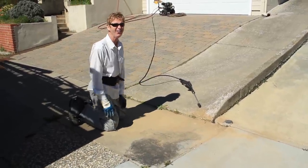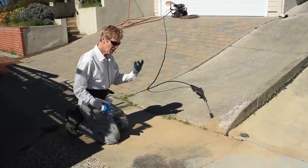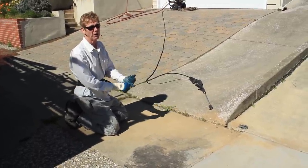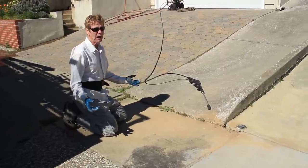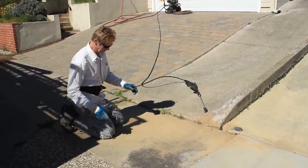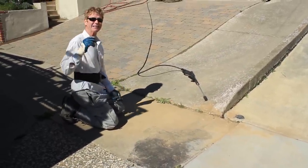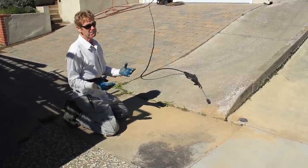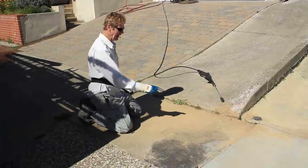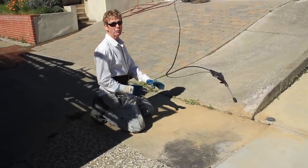She says, well, I saw your video — and I thought, oh, one of my most controversial videos. I'll put it in the description. But anyhow, there's a way to do this, but it's for plasterers or people who are professionals because the material is not sold at Home Depot or Lowe's. It's poly bond — that's at the plaster and material yard. What I'll show you is after I pressure wash this — because nothing adheres to dust — I'm going to apply a thin coat of poly bond. That is a cementitious adhesive used to hang styrofoam on brown coats. It's strong stuff. After I put one thin layer, I'm going to come back and feather in higher there. Here we've got an inch.